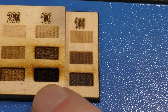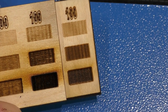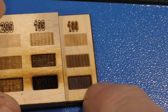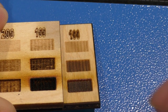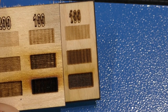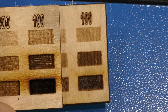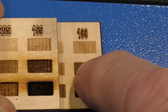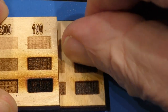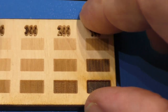There's the standard inch and a half engraving lens, probably 2 millimeters deep in there, and very black and tarry. This one is about maybe a millimeter deep, maybe half a millimeter deep, so it's substantially shallower. It's black, but look at the tar around the outside. It's not there. This one, color, a little teeny weeny bit of depth, but again, about half the depth of this one. These, virtually no different.